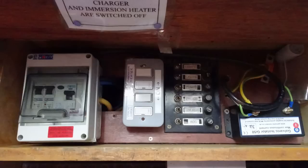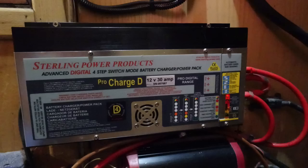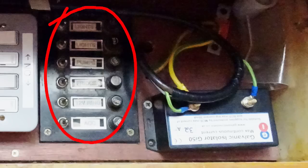In the picture you can see the original arrangement — one consumer unit, a switch box switching the immersion heater on and off, and the battery charger, because previously I had a separate battery charger. There's also the control panel for the 12 volts and the galvanic isolator. The switch for the immersion heater and the old battery charger has been removed and replaced with a similar consumer unit. Now if the power goes off, the immersion heater also goes off, so it's no longer a worry. I tend to leave the immersion heater on all the time, and if I was away from the boat and the power went off suddenly it would drain the batteries — that's now been overcome. I'm very pleased about that.